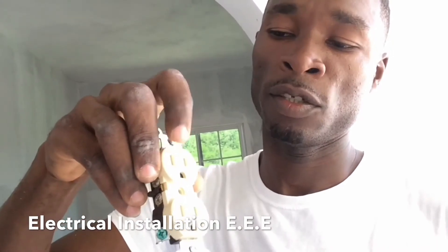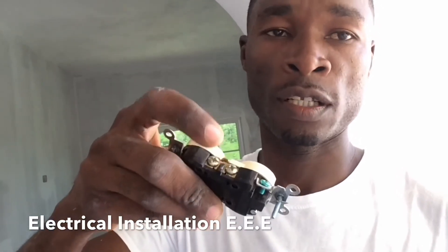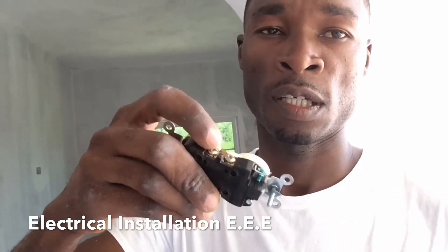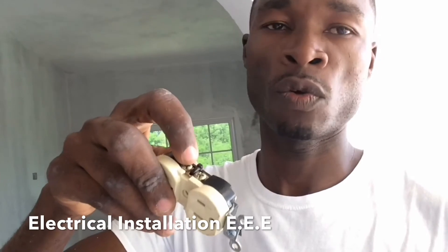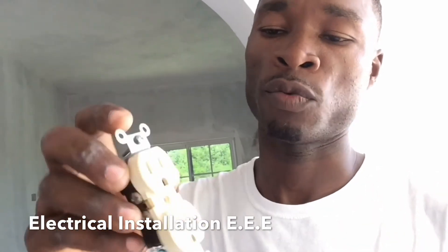So the three steps are: one, the neutral side hole is longer than the live side hole; two, the neutral side should have aluminum or silver screws; three, the neutral side is always on the ground side. However, on this particular plug, both screws look copper — it depends on the company or country that made it, because a lot of these are knockoffs and not real quality plugs, to be honest.